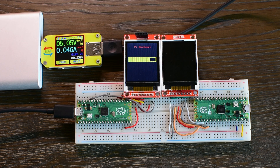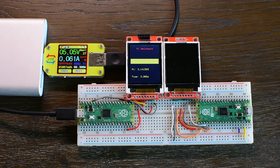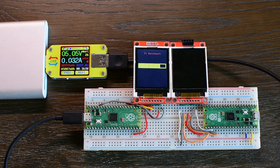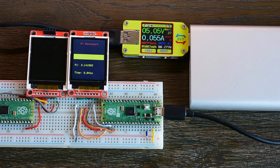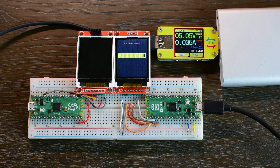Let's now take a look at power consumption. At 133MHz, the Raspberry Pi Pico and the display draw about 46mA, and when overclocked to 240MHz, they draw around 60mA. Running the Pico at 50MHz brings the current down to 32mA. In comparison, the Pico 2 together with the same display draws about 42mA at 150MHz, 55mA at 300MHz, and 34mA at 50MHz. All measurements were taken at 5 volts during the benchmark. If using the RISC-V cores, the current draw of the Pico 2 is about the same.